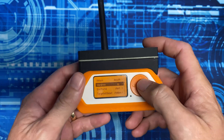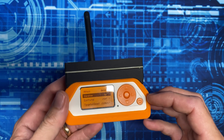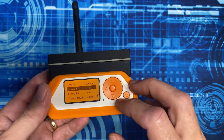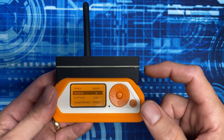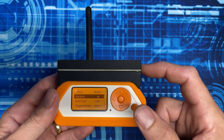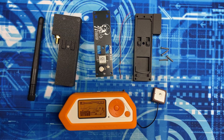The reason we need this expansion is because the Flipper Zero was never meant for this - it's meant to be a sub-gigahertz machine. So we needed to add this ESP32 board to get it up into the 2.4 gigahertz range, along with GPS to make it location aware, giving it everything we need to war drive. So let's jump in.